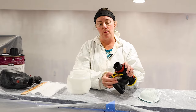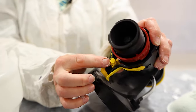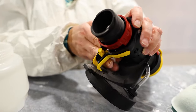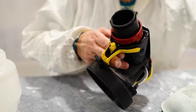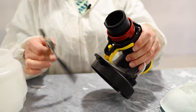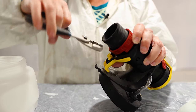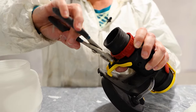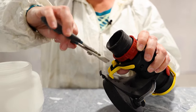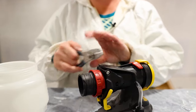There's a little nut on the back here. You want to tighten that nut as much as you can before you start painting — it will give you maximum pressure. Just grab a pair of pliers and tighten it. If you want less pressure, you can loosen it, but you want this as tight as you can.